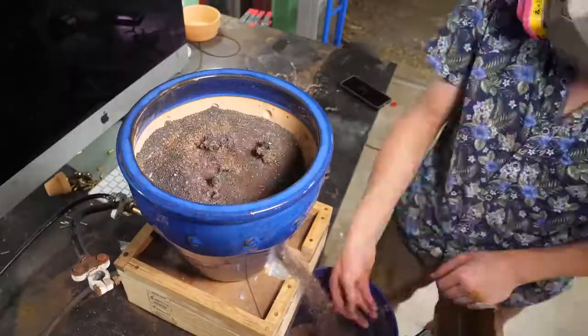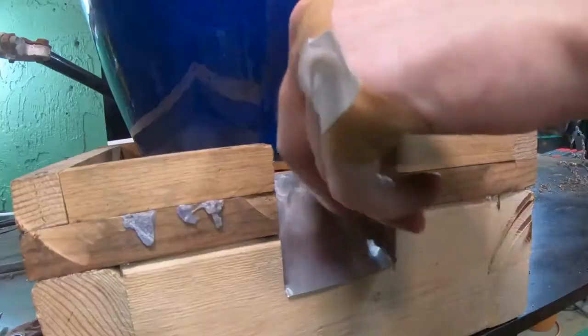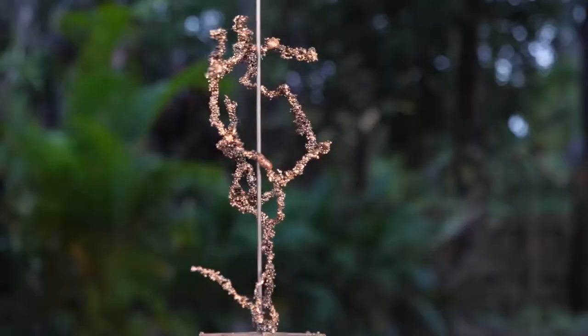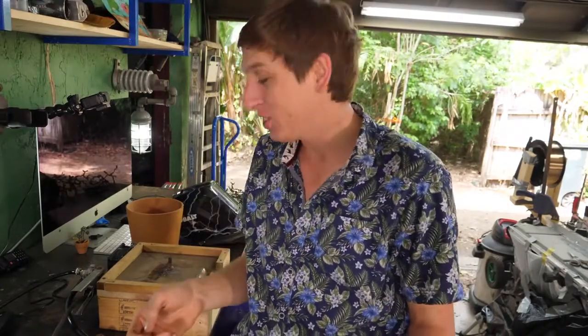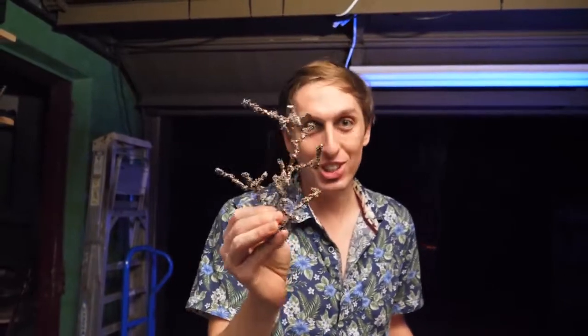I am super happy with the way this project is turning out — this is exactly how I envisioned it. Each piece looks super unique, organic, like some kind of coral or petrified lightning. I had another idea that might have been a bad idea — separating all the steel BBs with a magnet to try using just the cut silicon bronze wire. That turns out it didn't work at all. I think the copper is just too conductive to the heat, so it sucks up all the heat away from the arc and nothing heats up enough to melt together. I'm super happy with the way these turned out. Some are still a little bit weak, but I figured out a good way to fix that — just coat them in a little bit of epoxy. And if you do that, you can add in a little bit of glow-in-the-dark pigment so it really glows in the dark. That's it for this video, guys — see you next time!